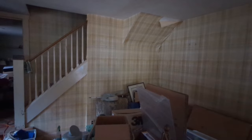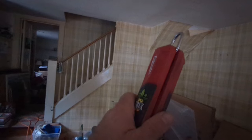And again, with this type of thing, the hot air that's coming off the basement floor is going to come right up and help the first floor. So you're going to end up with a zone on all three floors in the end, but you could take zone one up to the second floor or up the stairs, put that thermostat at the top of the stairs for now, and leave zone two off if we haven't actually built zone two on the second floor. And then zone one would call for heat until it was a comfortable temperature halfway up the stairs or more. And so then you ought to be able to play around with that and coax enough heat upstairs.